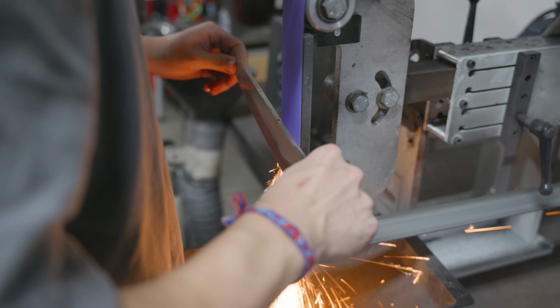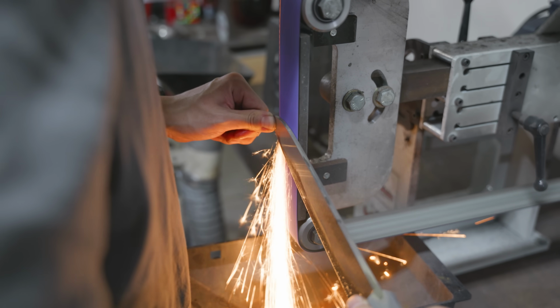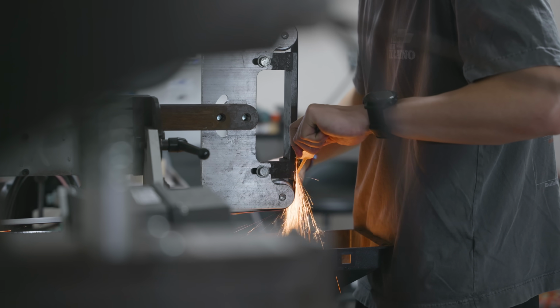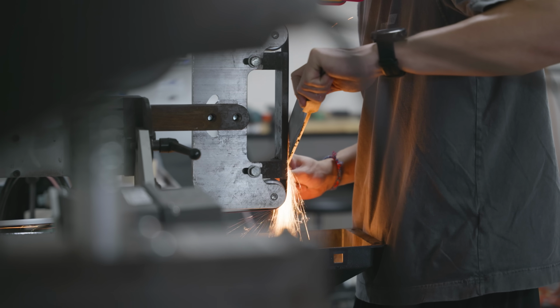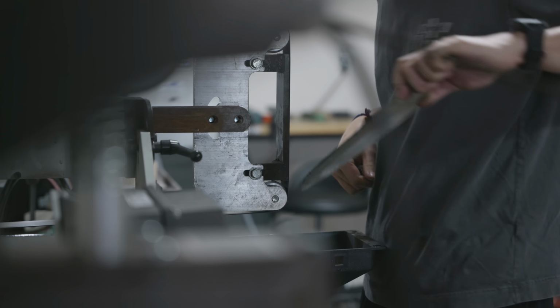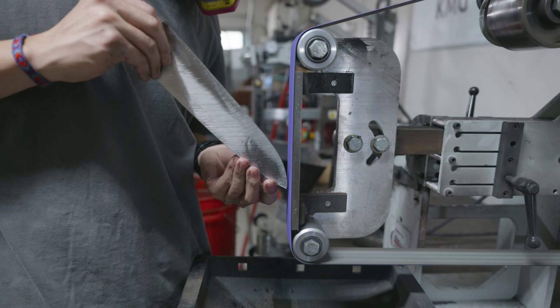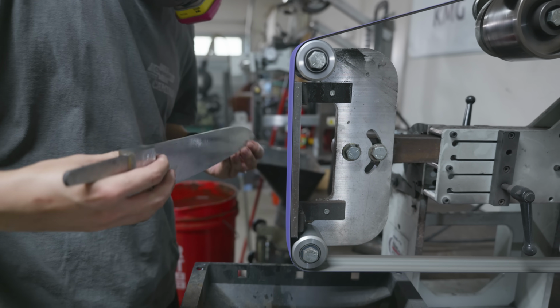I feel like there's a couple schools of thought in terms of chef knife geometry. There's the people that do the complicated B grinds, S grinds, there's the people that do the convex grinds, and there's people that do flat grinds. On top of these categories, there's also the complex Japanese grinds like the Yanagiba, which has a hollow on the back, you have the single bevel, you have the double bevels, you have the differing sharpening angles, even with the same bevel angles, and yeah, there's just so many.